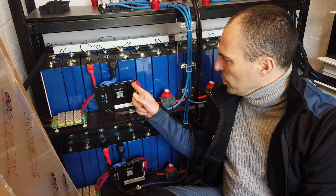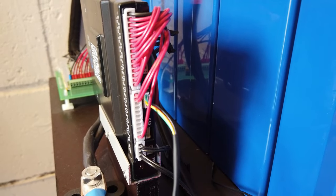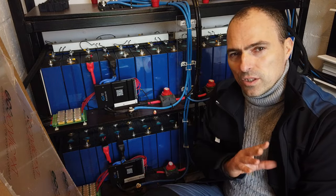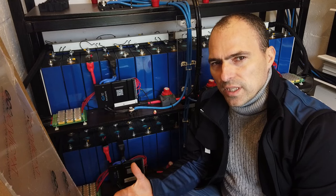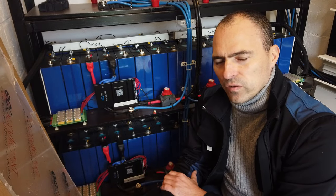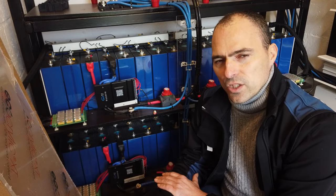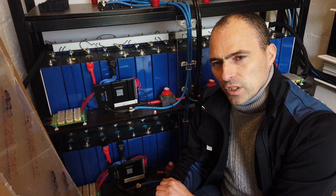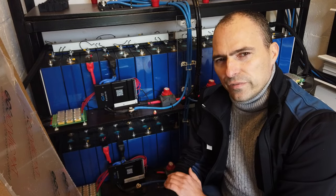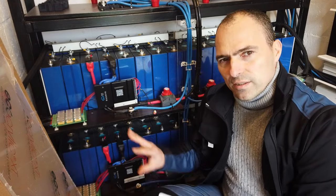When we have a close eye on the BMS, you can see the BMS leads. I have wires from the push button and the two temperature sensors. I have no communication between the BMS and the system and the inverter — that's a personal choice. I don't want to make the system too complicated. I have a shunt that takes care of the state of charge and the communication between the system and the inverters. The BMS has to do one thing: control the battery. All the other information is too cluttered.